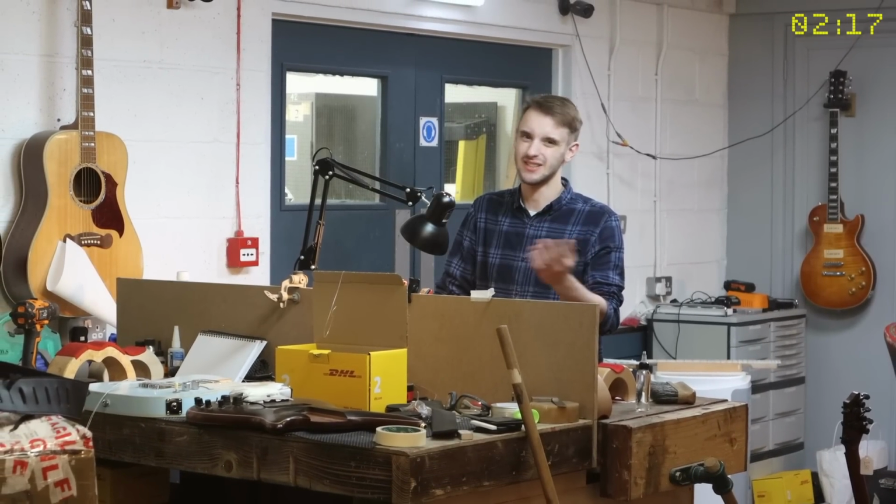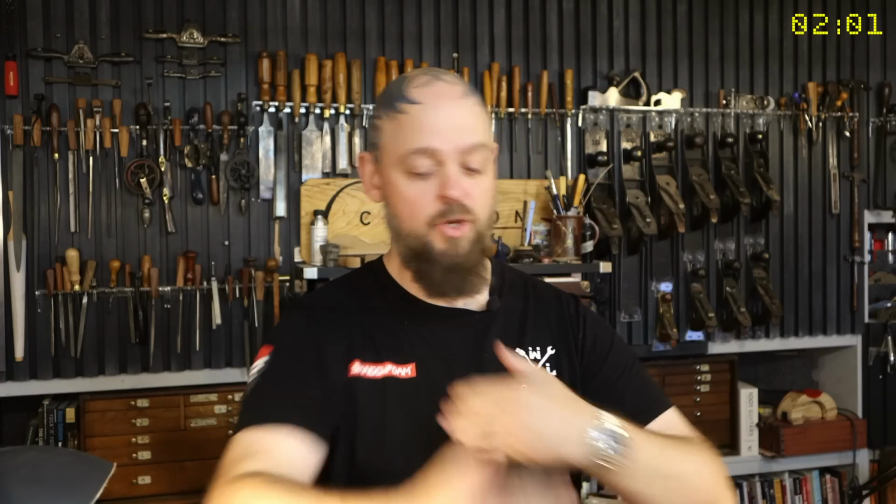He says it is the third super secret body sensor, transducer, microphone kind of a thing. I can't say the word transducer, which means, hey, it's a piezo. Piezos work by transforming physical vibrations into electronic signals, which is exactly what this is doing. It's picking up the motion of the top. There would be no reason to put a microphone directly under the bridge. There would definitely be absolutely no point in physically putting a microphone touching the bridge or the guitar, because that's not how microphones work. Secondly, and which was my first point, sorry, I'm as much explaining my thinking to Sam as I am to you guys.